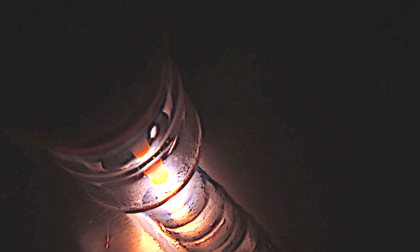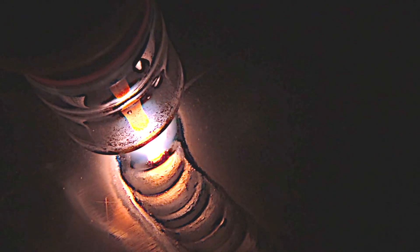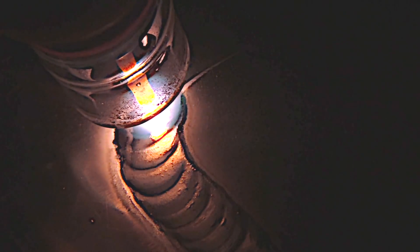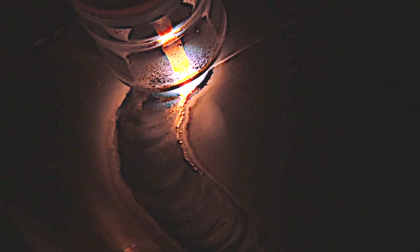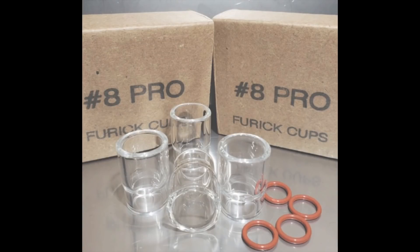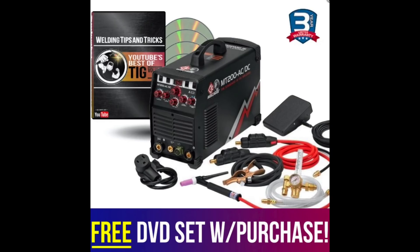I don't always use clear cups, but they sure can help you see better and see where you're going. If you have to weld into a corner, you can look through the cup sometimes. This is a Furick number eight Pro — you can find it at weldmonger.com along with the other products I use in this video, including my TIG finger and TIG finger XL, completely made in the USA by friends and family. Thanks for watching.